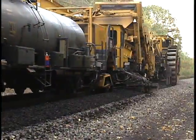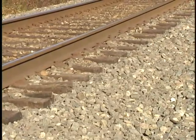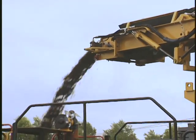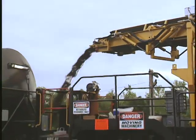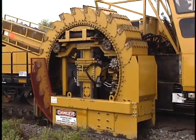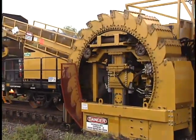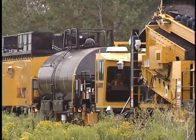Tie ends are broomed of loose ballast, leaving the track ready for resumption of revenue traffic. Waste material is discharged from the conveyors up to 29 feet from track center, either side of track, or is deposited into a dump car. The productivity, travel speed, and completion of the job allows the Model HP to get a lot of work done, even with short work block windows.